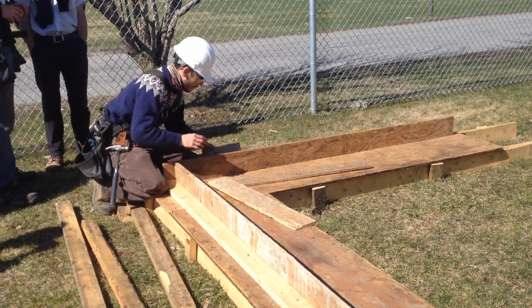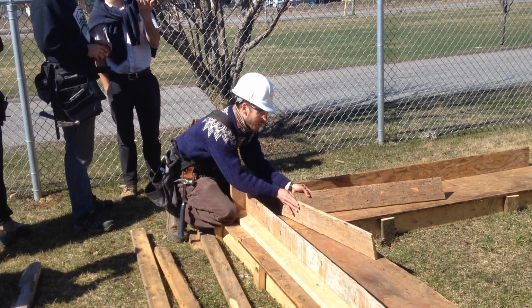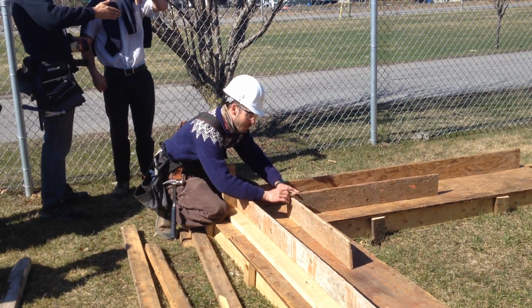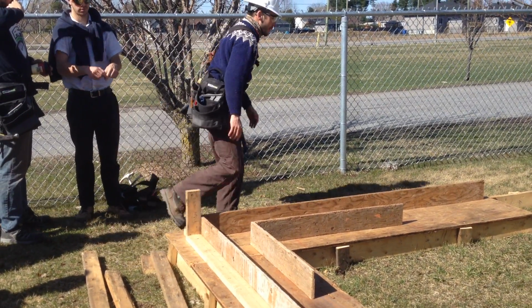So, this one over here, there'll be a corner stud over here. And how am I going to figure out the inside? Well, what's the rule of thumb for the inside for the plywood? The opposite. So that one went through, that one butt. So now I'm going to have that one butt, that one go through. I'm going to make it the opposite like this. Do you have some 200 mil tie rods over here?